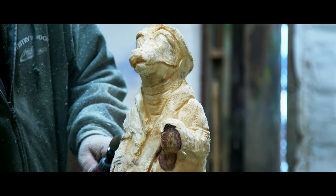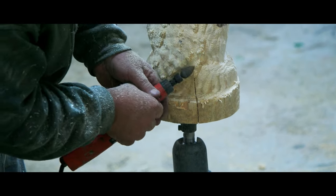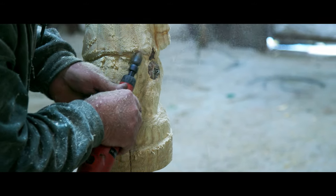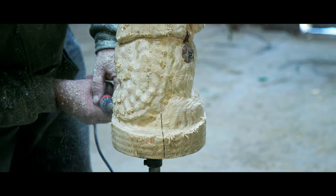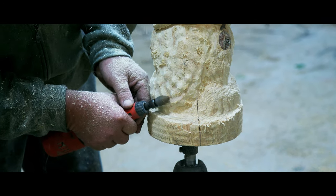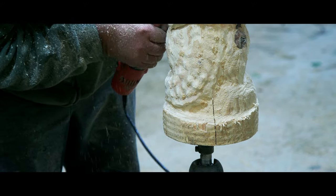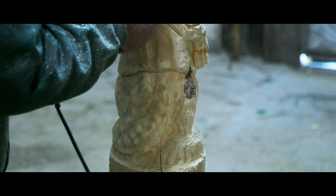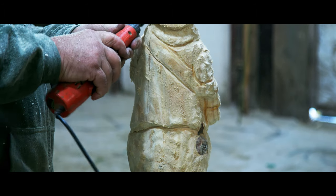You can use a green bit too, but a green bit would leave a lot of lines in it, and the orange bit would leave even more. That's why I like the fine bits — they don't mark it up very much. Now sometimes I do use some of the coarser ones when I want texture. You can use the actual teeth of the cutter to put texture in a direction you want, like fine fur or something. There's a time to use any of them, but just for cleaning the fuzz off, I like the fine bits because they don't carve the wood away too easy.